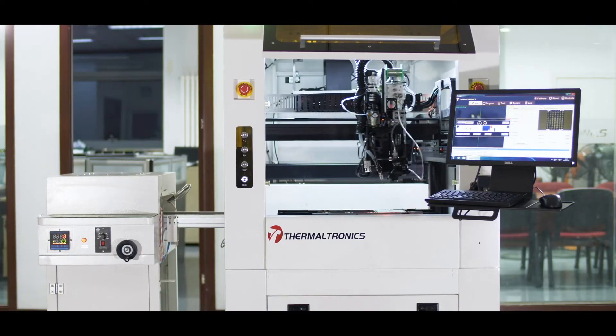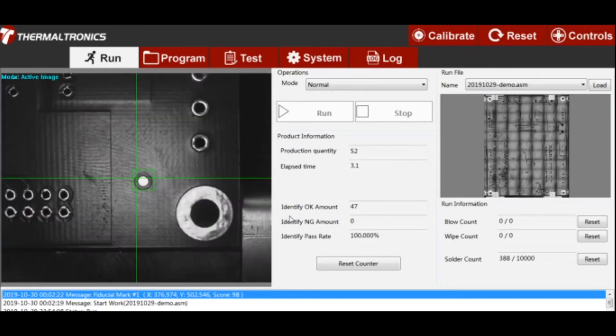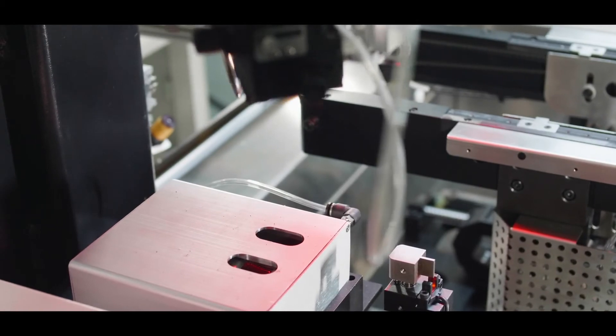Because contract manufacturers are looking for good pass-through cycle times. So is this able to keep up with line speed? Yes, absolutely. The actual soldering process you cannot speed up beyond the 2-5 second general cycle time, but the actual distance travel between solder joints you can certainly improve.